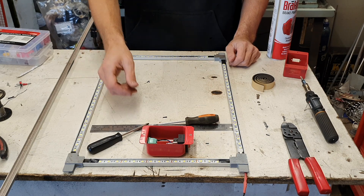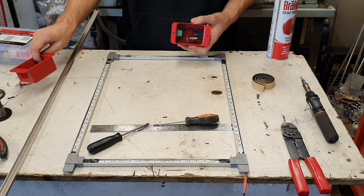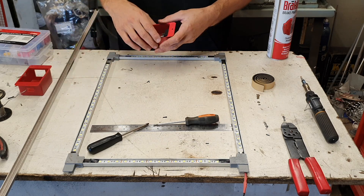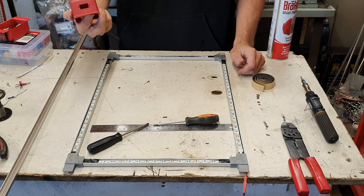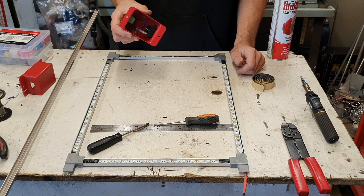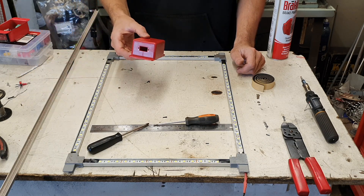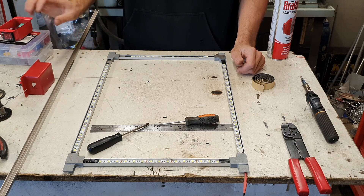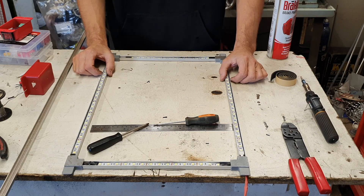I will be swapping this out — I have a spare one in plastic from the larger cabinets. The plastic corners give a little extra room and the way the corners are made it's just a bit nicer to work with. Being plastic, it's also easier for drilling additional holes to route more wires in and out. It's still fine to do with steel ones, it just takes longer. Since I already have the plastic version, it's just a much quicker approach for this cabinet.